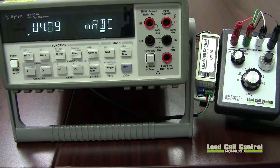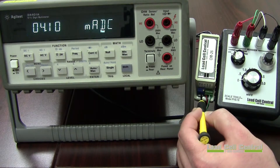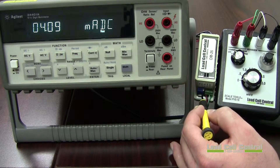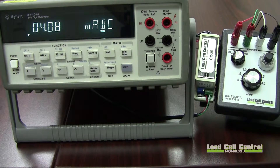Setup of the OM26 is a very simple procedure. First, we will set our load cell sensitivity dip switches accordingly. I will be simulating a load cell input with our PVS10, which can simulate any electronic strain gauge output up to 6 millivolts per volt. For more information please view our simulator video on our website. I will be using the 30 millivolts setting for this calibration to simulate a 3 millivolts per volt load cell.